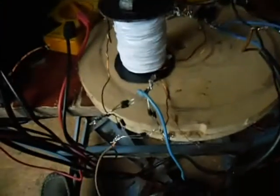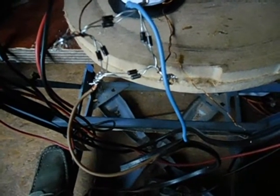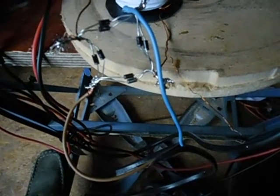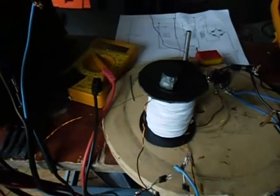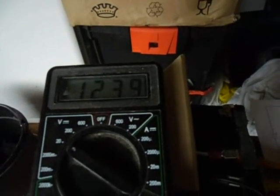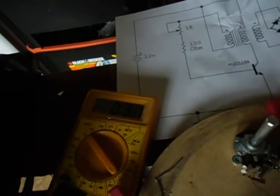Okay, back again. I now made the bridge rectifier go directly over it, and some adjustments to make here. Very hard to adjust it to the exact same current. Anyway, the primary is around 12.39, 38. I'm now using 310 milliamps. It's going slowly up. 320. The potmeter is not very great for adjusting at this moment.